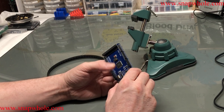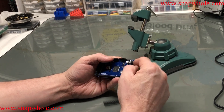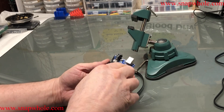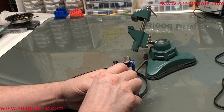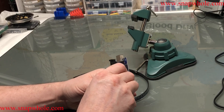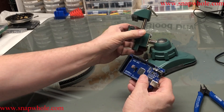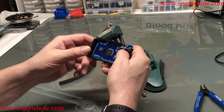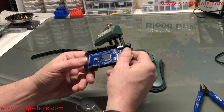So I'm going to try to replace that. I have some replacement chips — 5-volt regulators, it's the same part. I'm not going to try to take that off in one piece; I'm just going to clip the leads. So this works other than that, but I can't use it with a RAMPS board like that — it doesn't want to work correctly.